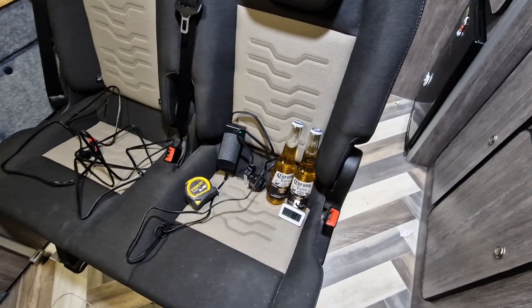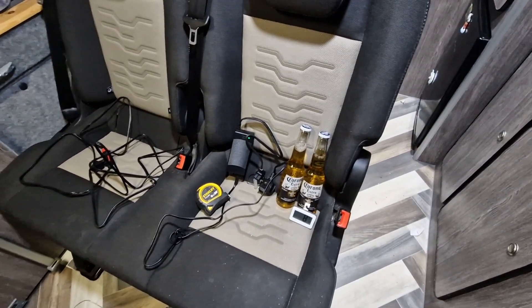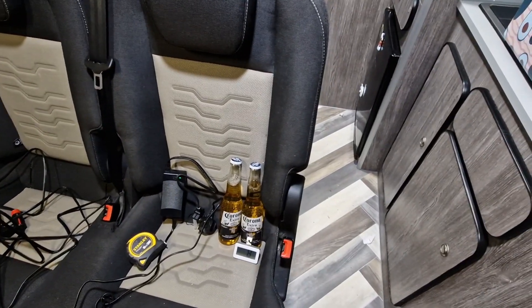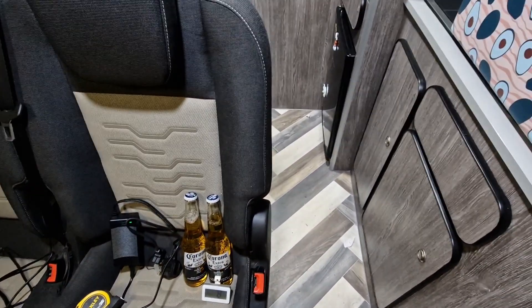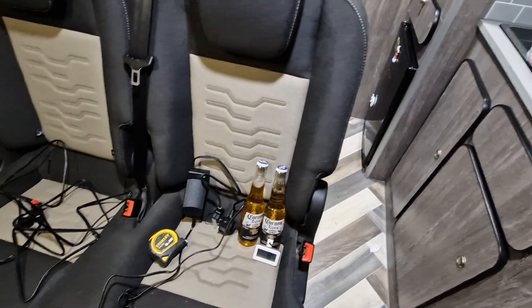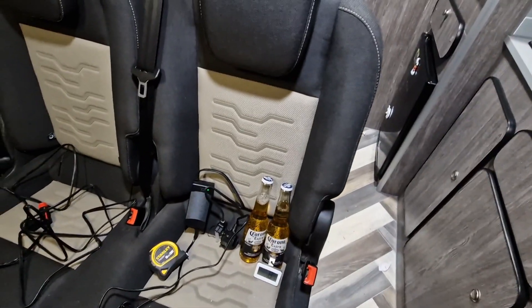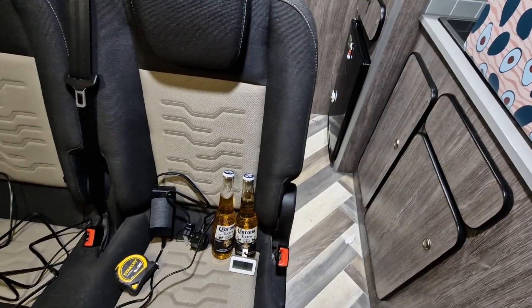So for the purposes of today, I'll run it off the inverter - I've got a Victron inverter - so we'll run it off that and just see how we get on. The Victron inverter doesn't like being on eco mode running this thing. It likes to be on the sort of permanent mode. The fridge likes to know it's got a constant source of power - it doesn't like it when that's not clear to it. So if you've got a Victron inverter with an eco mode, you'll understand what I'm talking about. I'll just hook that up quickly now and talk you through it.